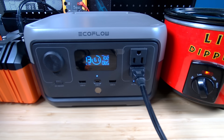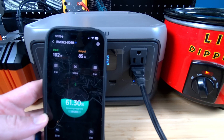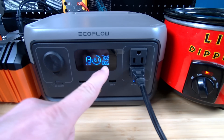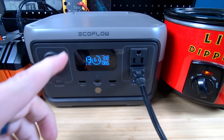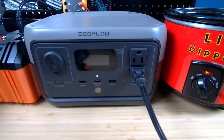This has been sitting for a couple minutes and everything's working fine. But one interesting thing: even though we've got more power coming in than going out, the battery is actually going down ever so slightly — very, very slowly. It's gone from about 61.5 to 61.4, then 61.3. Even though we've only got 85 watts going out to the little dipper, it still takes power to run that inverter, and that's some of the conversion loss you get. So we're seeing that happen ever so slightly. Even though we are losing a little bit of power, we are still adding capacity to our overall system by including this extra battery.